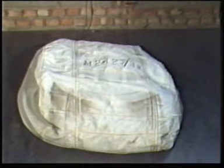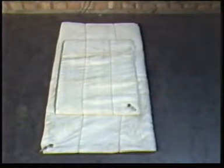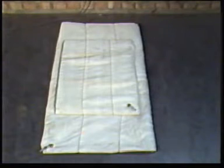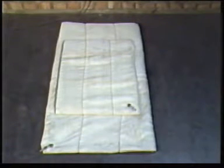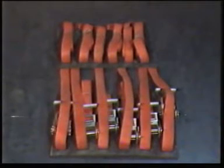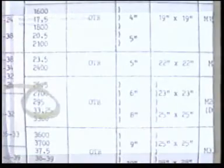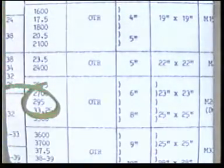The repair components are made up of a flexible heat pad for both inside and outside use, a cylinder airbag to form the core. The inside flat airbag will take up the inside profile of the tyre, and the outside flat airbag will provide the external pressure. The OTR system is supplied with a 6-strap harness, which serves to contain the pressure being exerted by the airbags, and therefore direct the pressure into the repair area. The application chart indicates the components required for the repair of a particular tyre range.